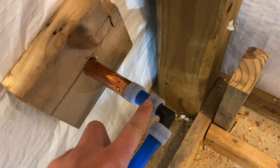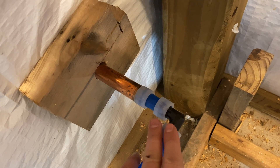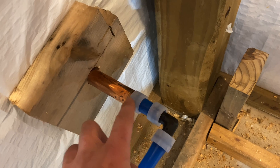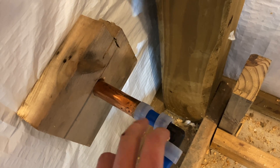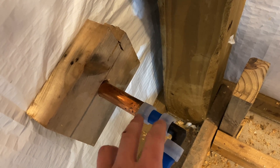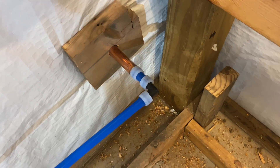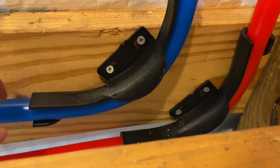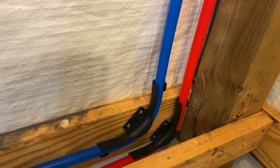One little trick while I'm showing you this — I screwed this up the first time. Anyone familiar with PEX-A knows how this works, but you have to expand both sides at the same time before you put each end in. You can't do one and then stab it and then expand the other one — the tool won't work. You have to expand the whole pipe together and then it'll work. I only have about an inch and a half of pipe there, so it's really nice for this kind of minimum-distance joinery where space is an issue. Here's a close-up of those Holdright brackets — the pipe just clips in and provides tabs where you can screw it in. Very nice, makes it cleaner.